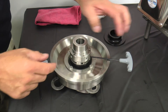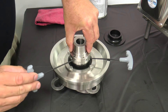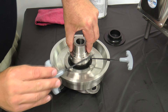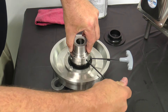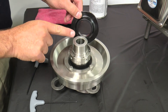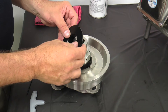Install an eighth-inch Allen wrench between the tab washer and the spring retainer for spacing. With the back plate against the impeller, push the spring retainer down to compress the springs until the length of visible spring is approximately one-eighth inch. Lock the spring retainer in place by tightening the two set screws with a one-eighth inch Allen wrench. Next, remove the spacer Allen wrench. Install the deflector onto the impeller shaft, taking care to line up the indicator mark on the deflector with the keyway on the shaft.